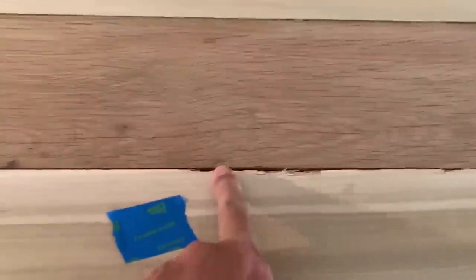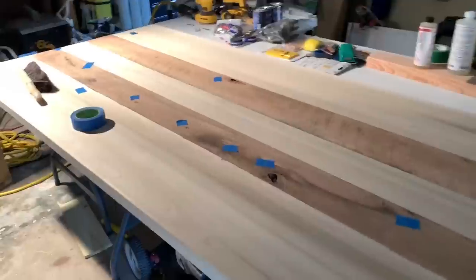So it's mostly knot holes except for some little places like this. And then this one, a pretty good sized crack that's almost a quarter of an inch by the time it gets to the end. I'll start pouring from this end and work my way that way, let the air escape from down here, and try to minimize bubbling that way. So that's what it looks like.